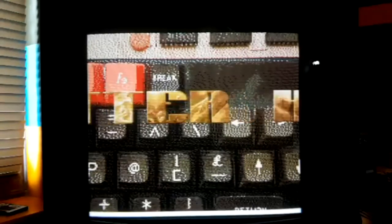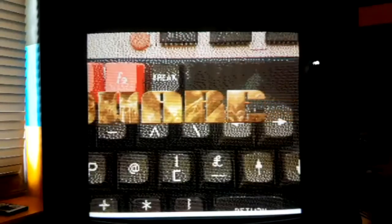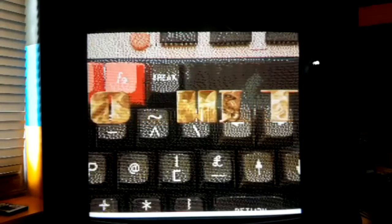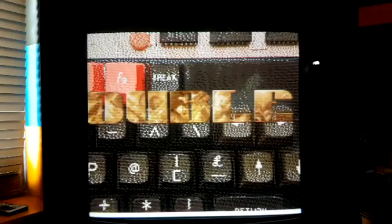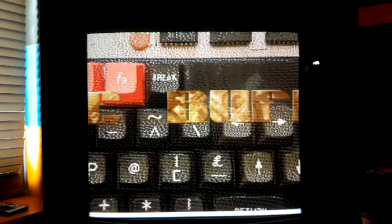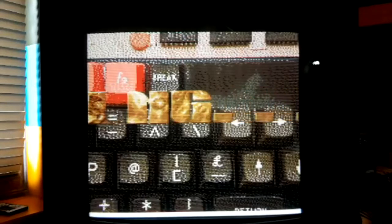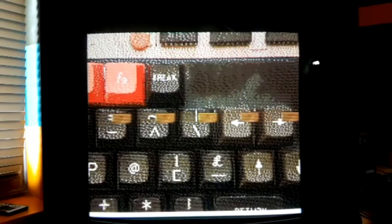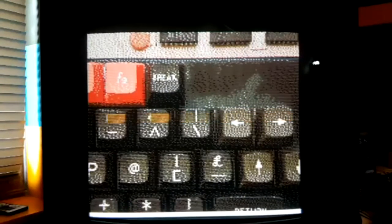The other thing that the blitter does is when you're plotting sprites with it. Each of these letters is basically a sprite, and as it plots it, it will save what's underneath it to another buffer. So instead of starting with a blank screen each time and writing the text, it's writing the text out, copying the background screen to the real screen, and then unplotting all of the text before it replots it again, scrolled along a bit. In the real world, you probably wouldn't do it like that, but it's just to test out how quickly the hardware could work.